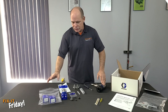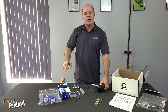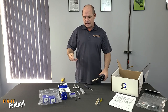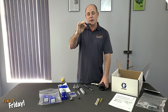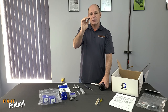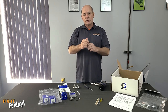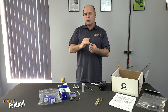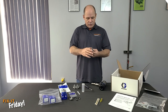Moving along with the unpacking, you'll have three cartridges that come in the kit — blue cartridges. Along with that, there are going to be some more specific tools. The gun does not come with the cartridge and mixing chamber assembled already, so what you're going to need to do is do the first assembly for that. The air cap. We call this the divider tool — this is a tool used in the process of cleaning the cartridge. And then the grease tool, which is a tool that gets adapted to the grease gun to flush out the cartridge. You'll notice right off that the mixing chambers are a little bit different from the AP Fusion — a little bit different design. They've got some grooves in it, and these grooves are really important to be assembled properly as they will line up with the cartridge when you go to assemble it.